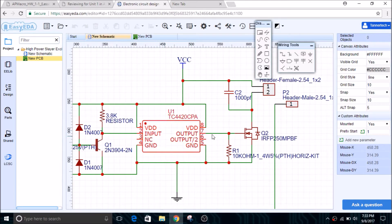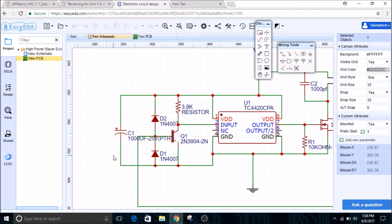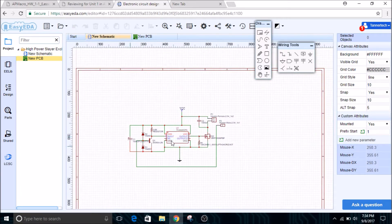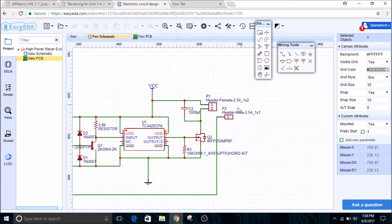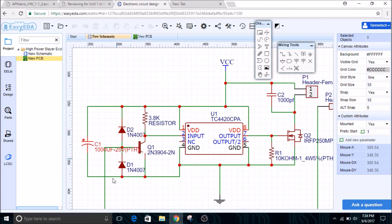The MOSFET driver chip takes an input and gives a non-inverting output that drives the gate of the MOSFET, because the gates of MOSFETs like to draw a lot of current. This 10K resistor is just to drain the gate. We also have a resonant capacitor right here — this capacitor will help the coil resonate at a better frequency, saving power and making it more energy efficient. These two diodes here are to clamp the voltage coming in from the feedback, because this feedback is at the lower end of the high-voltage secondary coil and the voltage is going to be relatively high. So we use these two diodes not only to rectify the current, but also to clamp the voltage so that way it doesn't destroy the transistor.